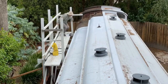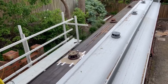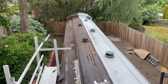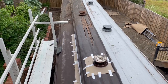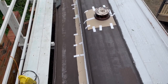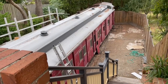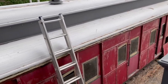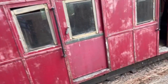We had other things to do on the roof too — those little gray whirly things at the front provided air to the train, but since it's no longer traveling on a track they don't really work as intended. Parts of the roof were really quite rotten; I dug them out, used a wood hardener, filled various sections, replaced some timbers, and used various compounds to create a nicely sealed area. My mate Richard and I worked on this roof together — he helped with the scaffolding, thinking, paint, and the metal for the clerestory, which is the raised section in the middle.